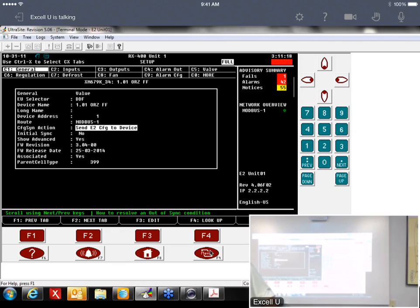Yeah, but they'd be uncontrolled. So what would happen is this one would control, and the other would be uncontrolled. It would come on with the case next to it. Well, that's what I'm saying, to get you out of a jam until we get the controller. But you'd have to starve that valve to like a max of 50% so you didn't flood out something. Yeah, that is something else too.